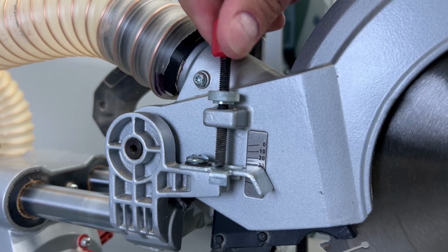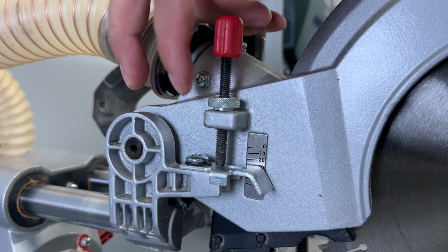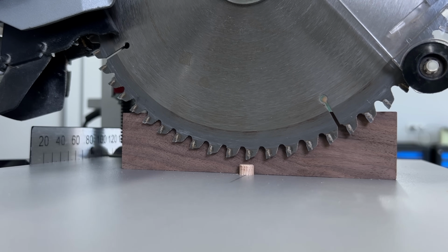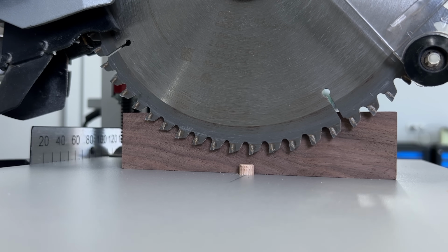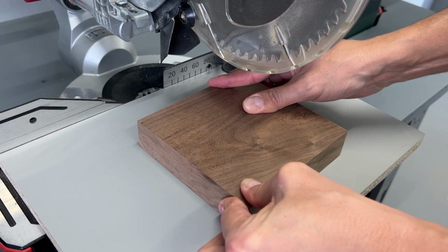I need to lower the blade as deeply as possible while still keeping a few millimeters of gap between the blade and the dowel. Here is the idea within the side view. This will be my lowest possible depth, but I will start a bit higher and gradually lower the blade to avoid any mistakes. If the blade goes too deep, the hole will be reached and exposed at the surface.